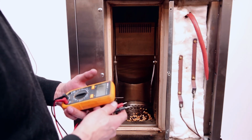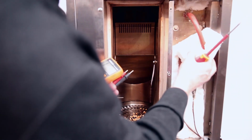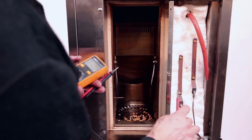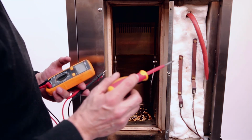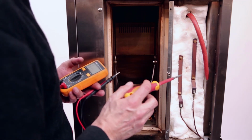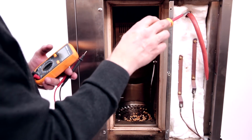For replacing the heaters, you will need to dismantle the heater's block by unwinding the bolts. To dismantle the current-carrying bus bars, remove the old heaters and install new ones. Note, please, that while mounting current-carrying bus bars, you must use current-conducting paste Molykote HSC+. In the upper part of the compartment, there is a sheath where the protective thermostat's bulb is inserted.